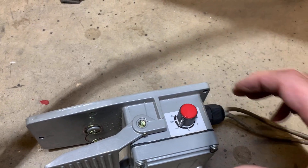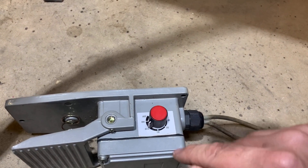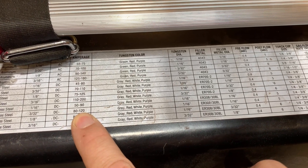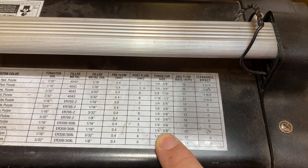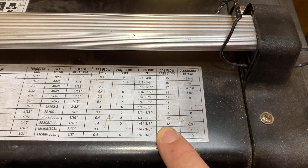This just kind of sets the maximum, so the farther down I push the pedal, the more power I get. If I push it halfway down I'll probably get about 55 to 60 amps. Also need to set the clearance to zero. Reading the specs, I'm going to be welding stainless steel at 3/32nds DC, 80 to 120 amps. That's my tungsten thickness, and I need my filler — actually, a 1/16th is what I have. Pre and post flow, TIG torch cup size — I need to change that and I can reduce my gas flow a little bit from where I was welding the aluminum.